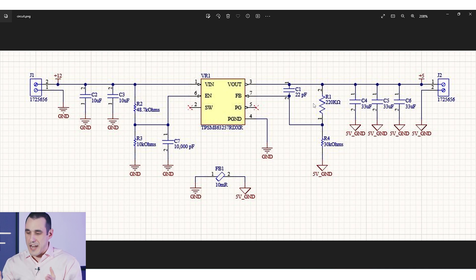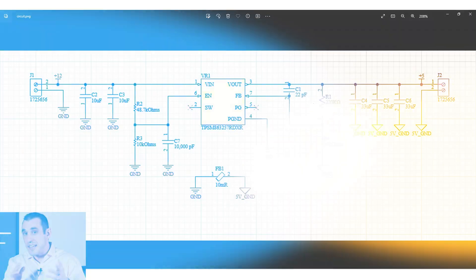The question asks about whether or not these two grounds are isolated. I constantly see this in bad PCB design guidelines. Most designers are inclined to use this method to link two grounds because it does eliminate the DC offset between them. At DC, those two grounds are going to be at the same potential because at DC, the ferrite bead is basically an inductor, and at zero frequency an inductor has zero impedance.